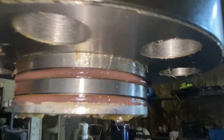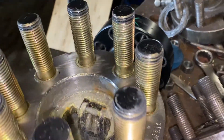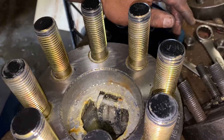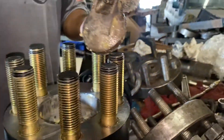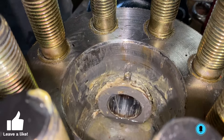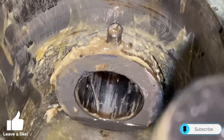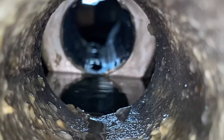Here's a closer look at the cap — it has two o-rings. These o-rings prevent any leakage past the cap. Inside of the valve you can see the disc and the disc retainer. Here we have the seat ring inside of the body. This valve was not leaking at the cap; it is leaking at the seat. Here inside you can see the seat.